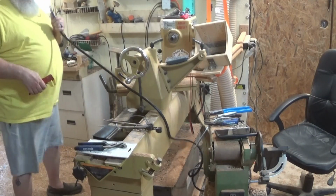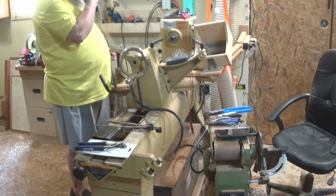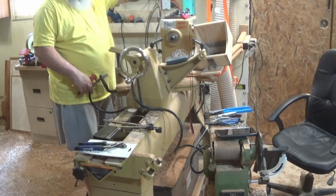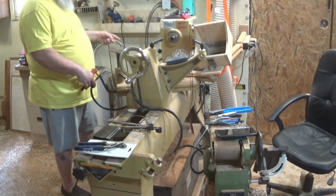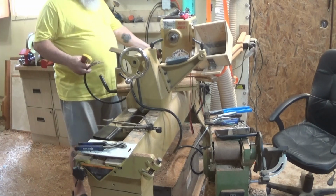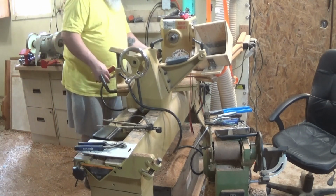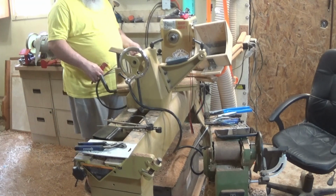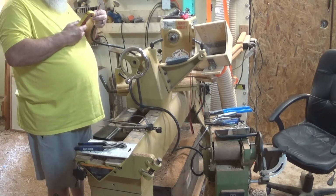All right, now around to the front of the box. There's 5 wires here that I need to connect to that go to the inverter. So this comes in 5 of these wires, and I made it extra long for a reason you'll see in a minute. One of them will go back out the back of the lathe and go to the A ground, the 10-volt ground for the potentiometer. So I need 5 wires going from the old switch wire bundle that's already wired to the inverter. I will hook 5 wires up to 5 of these wires, and they're all the same color code: blue, white, black, green, and yellow. So let's get blue, white, black, green, and yellow stripped so that we can tin them.